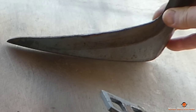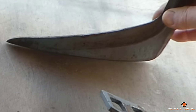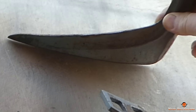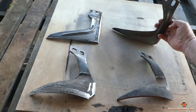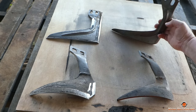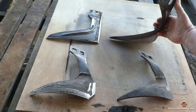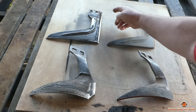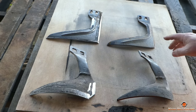It's not flat at all across the bottom, which means it's not parallel to the bottom. And you see, I think I had it adjusted like this. So right down here at that corner, you had a huge ring of sand building up. And right here at the top, where my finger is, that's where it would stop scraping the sides. And I would have that collar of sand from here up that would just stay stuck to the side of that drum. I took care of that by extending this. Now, it works great.